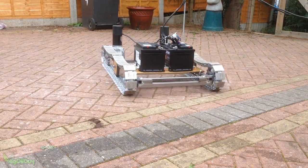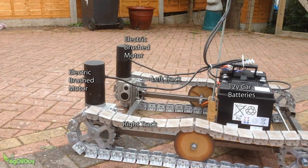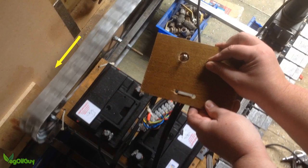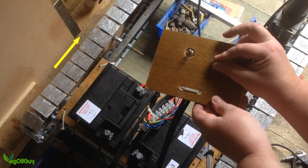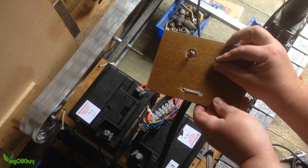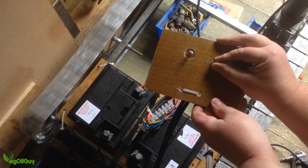So when I was controlling my caterpillar tracks, that's all I was doing. The tracks are driven by two motors — one per track — and by changing the polarity I was able to change the way the motors spun and the direction that the tracks travelled. Of course, it wouldn't be very practical to manually swap the battery connections over whilst trying to drive the model, so I used a couple of switches instead.